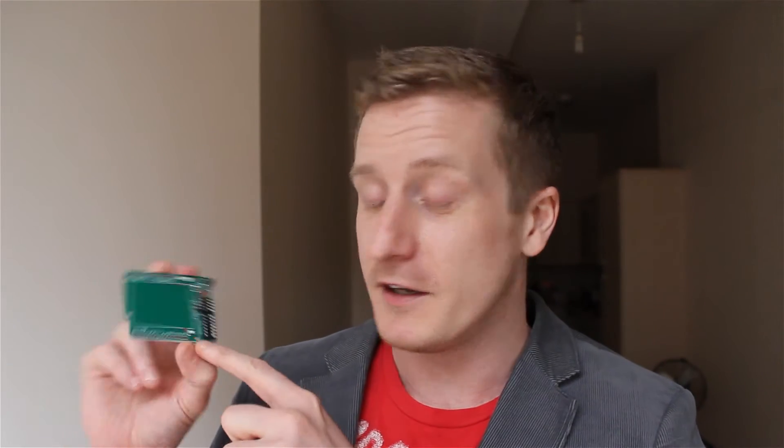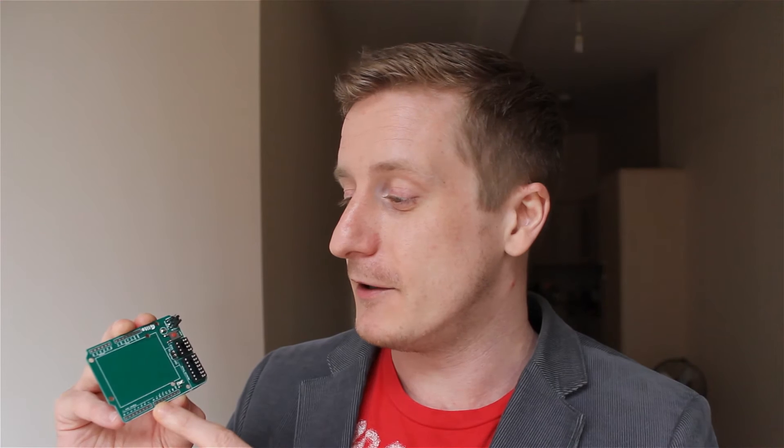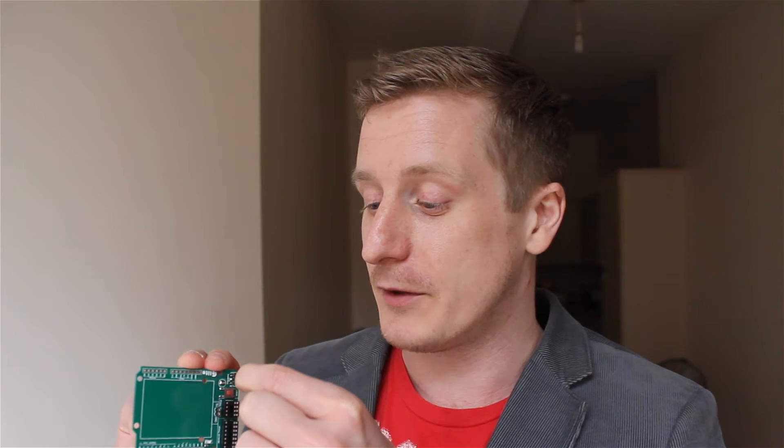The advantage of using a board like this is that if you're prototyping you've got a breadboard, you can stick everything on top of here and take advantage of the voltage regulation of your Arduino. You can put your ATtiny on the breadboard too if you want. Or if you're just building something off your Arduino and you want everything all in one place, it's great because all of these pins will come out on the header. These jumpers aren't actually needed anymore — the Arduino IDE no longer requires a capacitor from reset to ground — but this offers great backwards compatibility. It's also got a reset button on the top, and it breaks out 5V and ground to the middle of the board, which is very useful if you're taking advantage of those rails going across the centre.